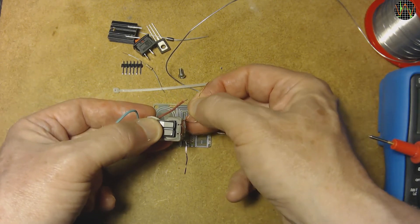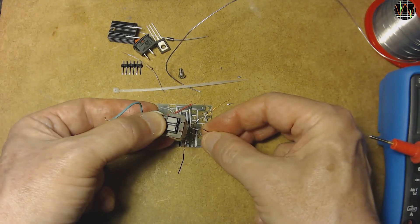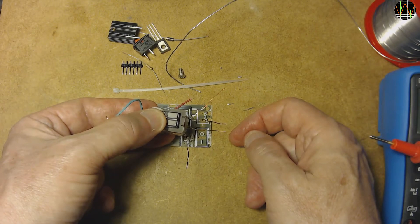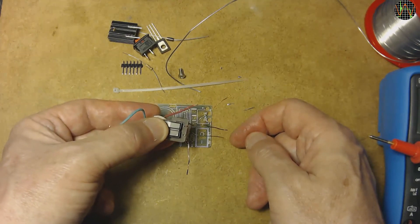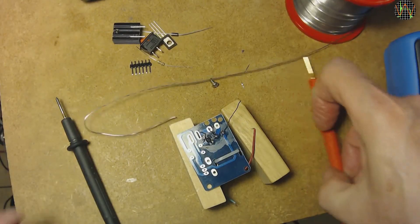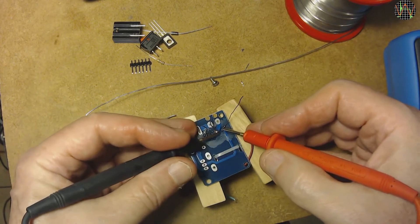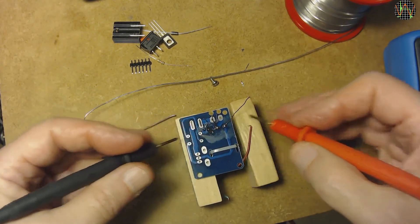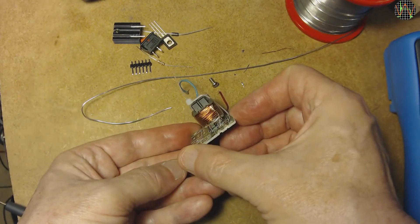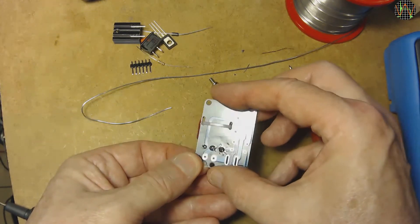So this is the new lead order I will use when soldering this transformer in. I start with the transformer because getting that right is the trickiest part, and by not having any other things soldered in yet, I can still measure which trace connects to which coil directly without having to consider effects of transistor, diode, and resistor. Despite all that scraping, the wires are still quite hard to solder in. Let's test the connectivity from left to center and from center to the right — all is fine so far. I forgot to mention that you are supposed to tie the transformer to the PCB using the supplied cable tie, which is barely long enough but it works.